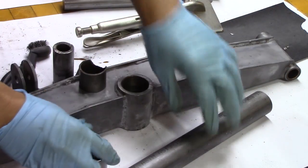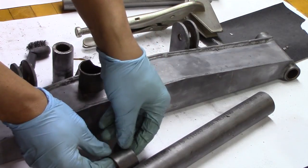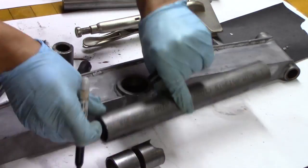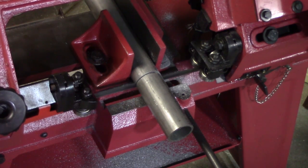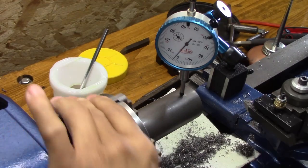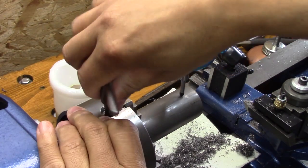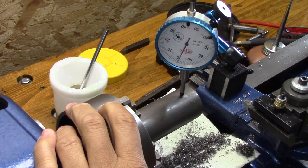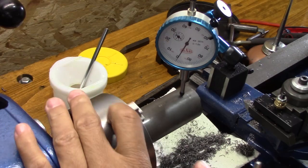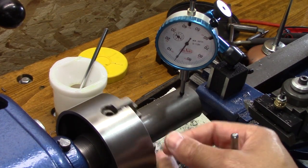Guys, this is the reason I started my Journey to Journeyman — I needed to make some bushings for my tractor restoration. So I restored my dad's lathe, went on Speedy Metals, got some stock, and said it's time to make some bushings. I got this baby into the four-jaw chuck, indicated it in as best I could, and got it to around about half a thousandth. I thought that's probably the imperfections in that little coating, so it's pretty true.